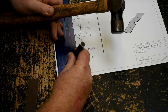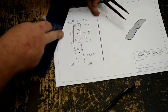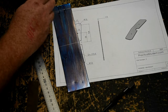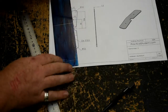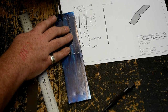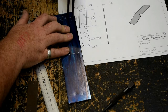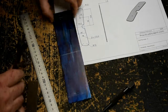Punch aluminium gently — it is thin, and it will work. Now I'm going to set my dividers to the same radius as the circles, R12, which all four are, and that will allow me to draw the circles. If I start at 10 on my ruler, I must go to 22 to have 12 between the divider points. Remember these are all partial circles, so I'm going to draw oversize in all cases, just to be sure I have enough of the circle done.